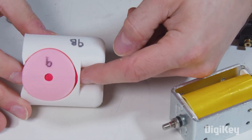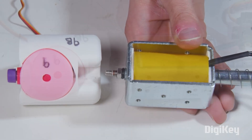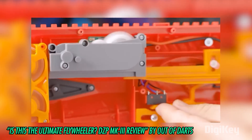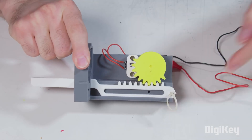To force the dart into the flywheels, he would normally use a solenoid. But to force the dart out of this mechanism he's created, he needs a solenoid with a much longer throw than any that exist. Instead, he's using this pushrod and half-gear mechanism, which does the job admirably.